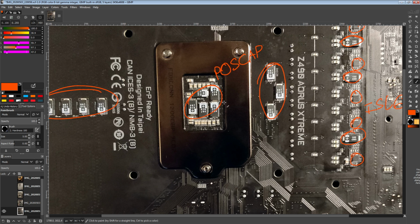Also, they've jammed them right into the socket, which is kind of interesting, because you'd think that having a bunch of multilayer ceramics would be better, since multilayer ceramics have even lower ESL than tantalum polymers in a molded SMD package, or aluminum polymers in the same style of package. But I'm pretty sure that with multilayer ceramics, the impedance of the capacitors on the motherboard ends up being so much lower than the impedance of the CPU socket that at some point, more multilayer ceramics on the motherboard just doesn't do anything, because you're no longer limited by the impedance of the capacitors, but by the impedance of the socket.